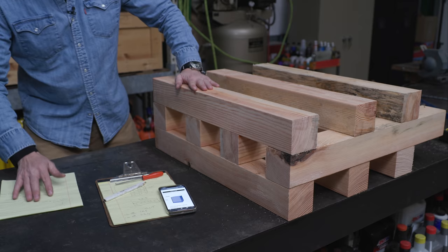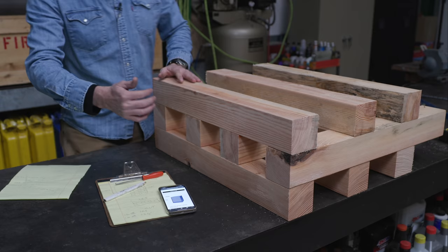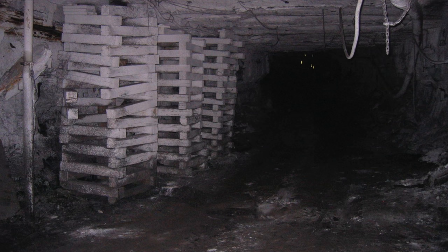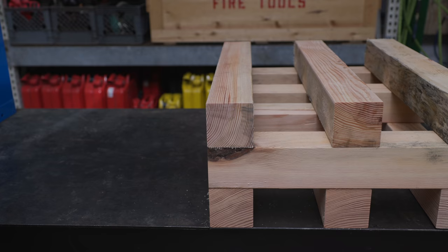I thought we would do a traditional cribbed base — that would be super strong and kind of an interesting look. Fun fact about cribbing: it's typically a 4x4 or 6x6 traditionally, and the rule of thumb is it should not exceed the height of its depth. So if it goes three feet deep, you wouldn't want more than three feet of height. The early mining industry used this heavily for shoring up the roofs of deep mines, and the first railroads used it for bridges and trestles.